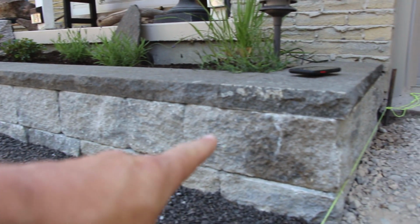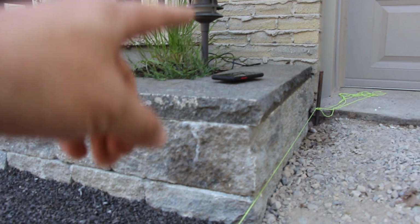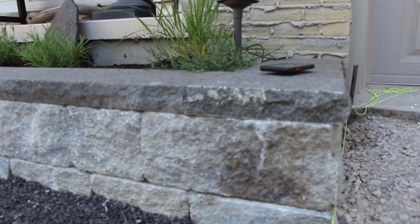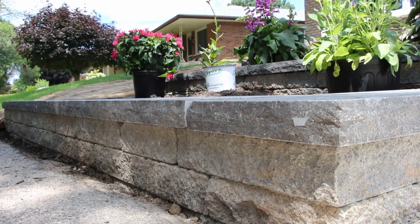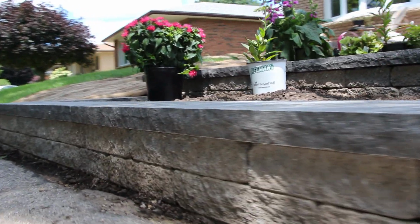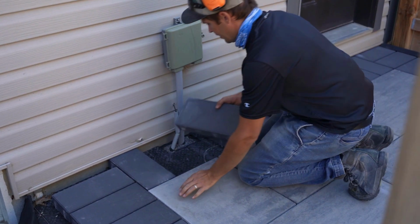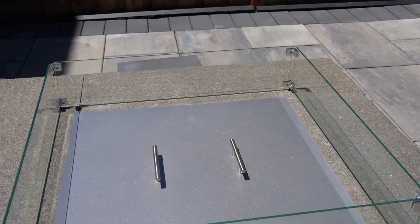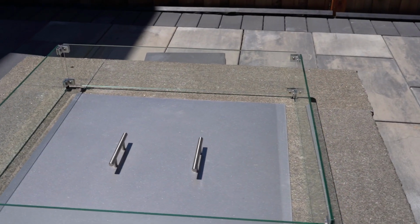I personally do not like aesthetically and functionally miters. Personally, it is not in my taste. I prefer to go square, if at all and when at all possible. This means things like the soldier or sailor course of a border for a paver project, or even the caps to a fire feature or a seat wall or a retaining wall.